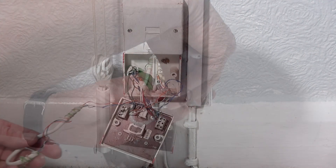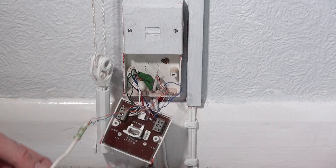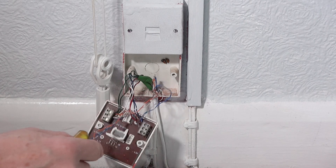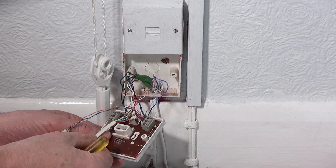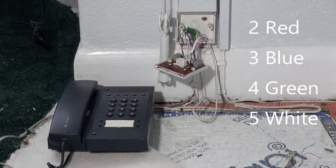As I said earlier, we've got to disconnect the old line, so I'm simply going to cut it out. I've also taken out the joining cable between that top socket, so that's totally dead now. I remove that cable and reinsert the new one — wiring red into two, blue into three, green into four, and white into five.